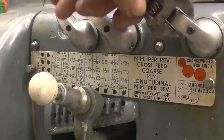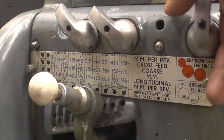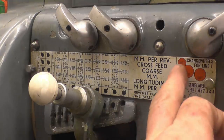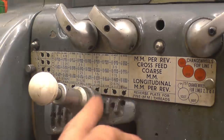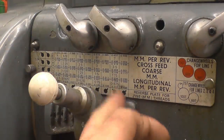I was going to do this in plastic first just to make sure all the settings were right, but unfortunately, I haven't any plastic big enough. Right, so we've got a 50 driving a 60, sorry, a 50 driving a 60 into an 80. That tumbler is on 6. Both those are backwards, and this one is forward.